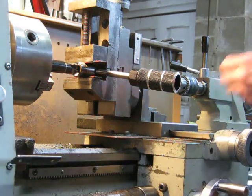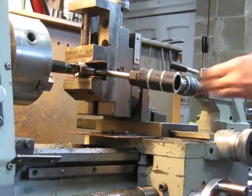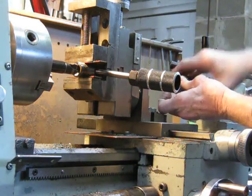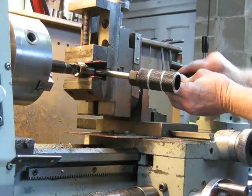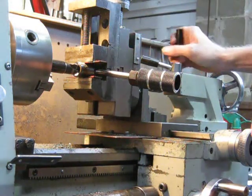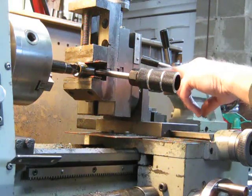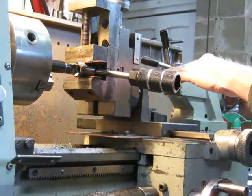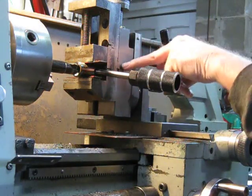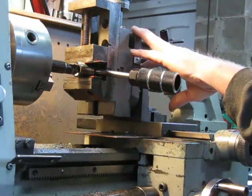So the best way to do it — it's very simple. All you do is you just have your drill in your morse taper, shove it in your tailstock, get a flat-headed bolt, stick that in your chuck, do up the chuck — doesn't have to be tight, just firm. Bring that up behind the vertical mill slide, lock it up, and what you're going to do is just use the tailstock ram to advance your carriage. By doing that you're advancing the carriage by putting all the thrust directly in line with the milling bit or drill, whatever you're using. No chance of canting, perfect positioning, and it will also reduce any chance of shudder because it will help hold it in position.